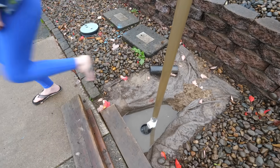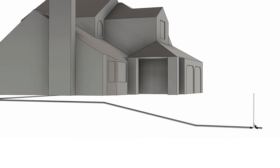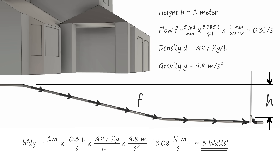But to find out exactly how much power is available, we need to go back to basic physics. Obviously, the higher the water is, the more energy and power. I'm going to be generous and say we have a single meter of height, because metric units make the math way simpler — and what could be easier than multiplying by one? During steady rain I was getting roughly two gallons per minute off my one section of roof, and with two and a half times that area, we should get five gallons per minute. After conversion, that's about 0.3 liters per second. This math will work with any fluid on any planet, so we need the density of water with the gravity of Earth. Multiply all the numbers together, making sure units cancel out, and we get a little over three watts.